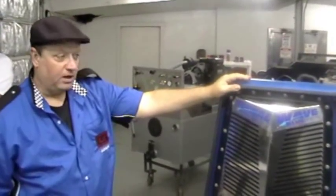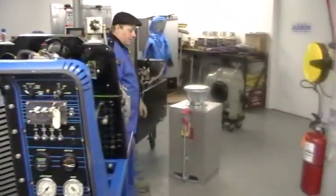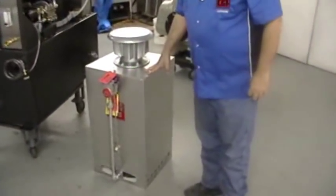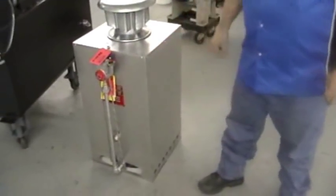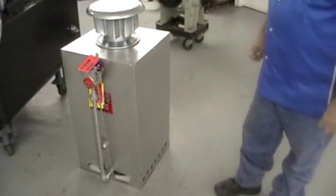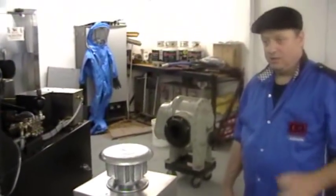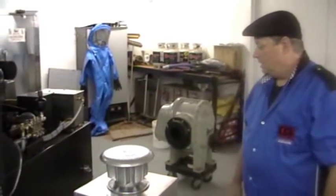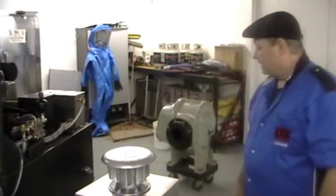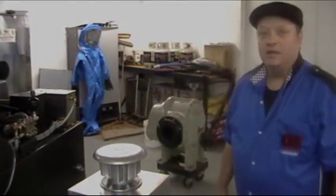The system will be running a Little Giant heater — here's the number four Little Giant heater, this is what we'll be heating it with now. This burns 0.9 of one gallon of propane per hour under commercial carpet cleaning conditions running a high-flow wand. Or it'll run two standard-flow wands — you can still run two wands on this unit — and it simplifies the unit. Next I want to show you the actual parts I took off.